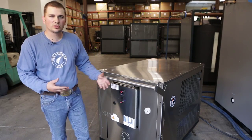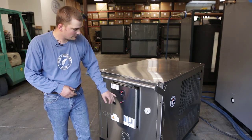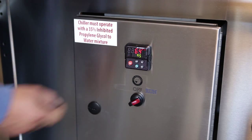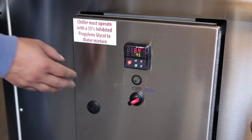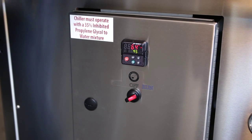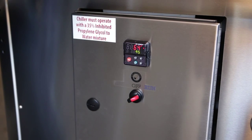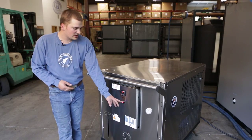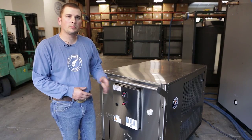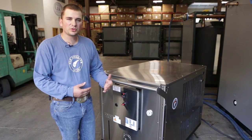In the event that you want it colder, by all means run it colder. These machines are designed to run at about 20 degrees as a safe set point. If you'd like your machine to heat, arrow up to your desired temperature — for now we'll say 95. You're going to hear the compressor shut off and you're going to see a light engage on the door switch, letting you know it's in heating mode. The heating element is engaged and it's going to start warming up the glycol. Once it's reached its desired temperature, this light will shut off and the heater will shut off. There's a two-degree differential on the thermostat pre-programmed in — so if it cools down two degrees from where you set it, the heater will come back on, and vice versa for cooling.